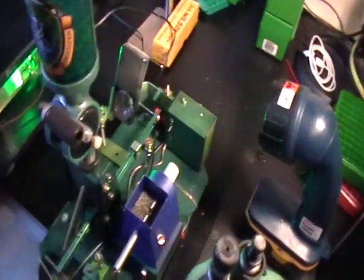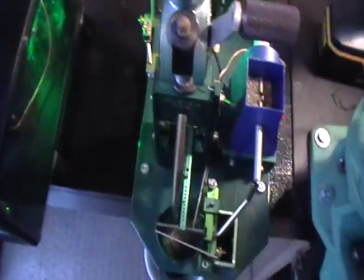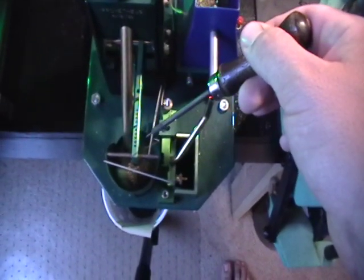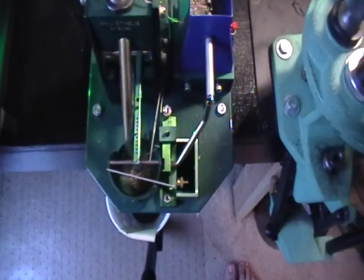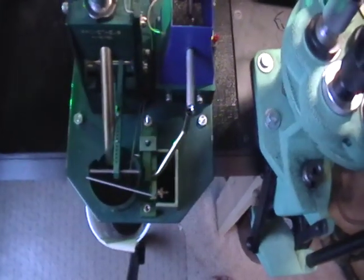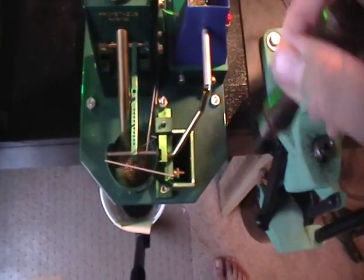On the rear, we have the needles and the magnifying glass that aids in determining if the needles are online or not. So what we're going to do now is go ahead and cycle this one time. When this cycles, this lift bar is going to raise this stopper out of the funnel, and then the whole system is going to come up. This is going to catch the top of it. When you put the hopper back down, it'll start to swing. The swinging motion will help get a real good accurate reading back here on the needles. And then we're going to trickle through here and do the whole system again.